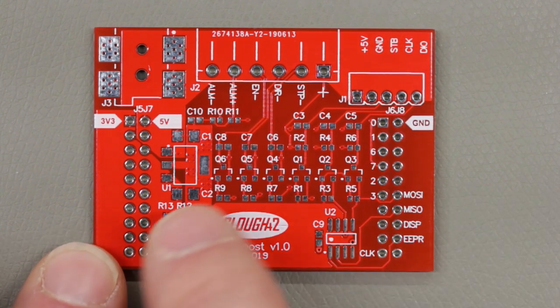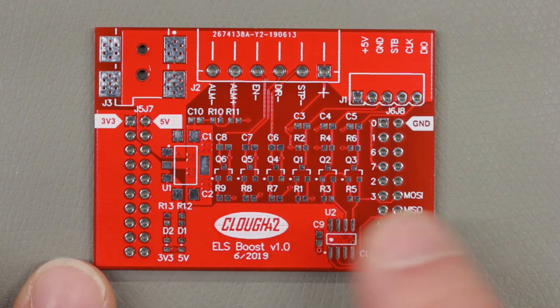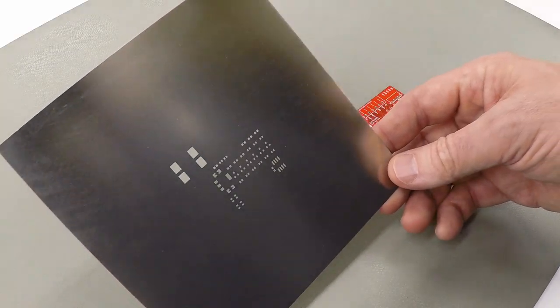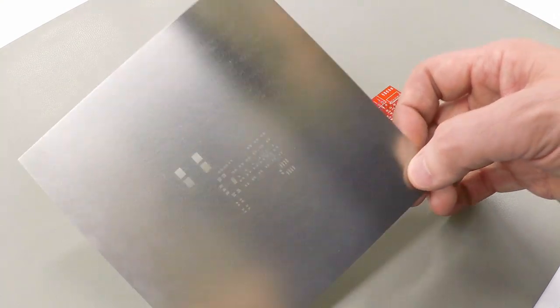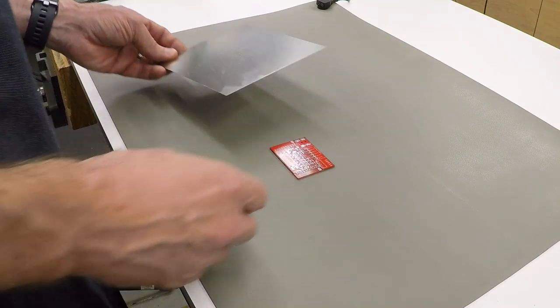Now I could solder these by hand, but I didn't use extended pads to make it easy to solder by hand because my intention is to solder these with solder paste and a reflow oven. To that end, I also ordered from the fab a solder paste stencil. This is just a sheet of about five-thou-thick stainless steel with holes cut in it for the pads where solder needs to be applied for all the surface mount components. If I lay this on top of the board, the pads show through exactly. Once this is lined up, you basically squeegee the solder onto it and that puts solder onto all the pads of the board. Getting this lined up repeatedly is a complex task, so I've made a jig to make this easier.